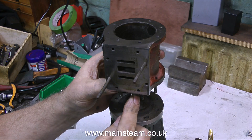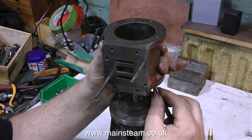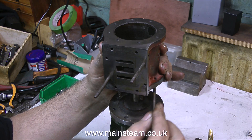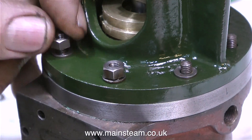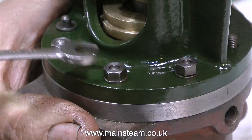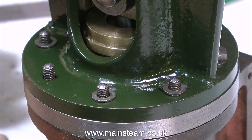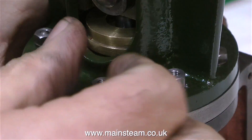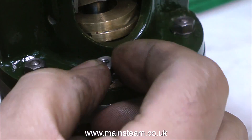I'm fitting the piston into the cylinder. Because it has piston rings, these piston rings stick out. Before everybody sends me recommendations for piston ring compressor substitutions — jubilee clips, nylon cable ties, and various other devices — as it turns out, this piston complete with its rings went into the cylinder very easily, because someone had the foresight to turn a taper on the end of the cylinder. The first piston ring went in just by hand pressure; the second just needed a bit of a prod with the screwdriver. I turned the whole thing upside down and I'm using some washers and two BA nuts to fasten it all together.